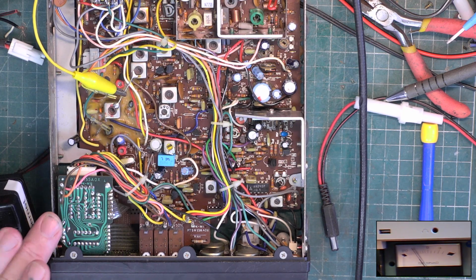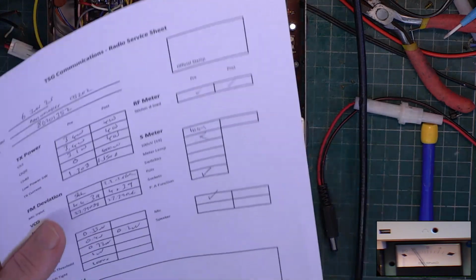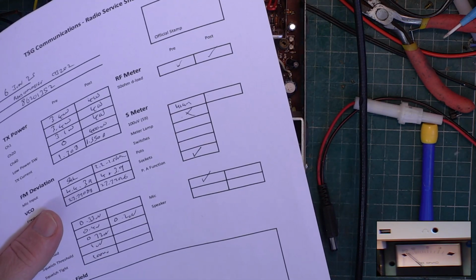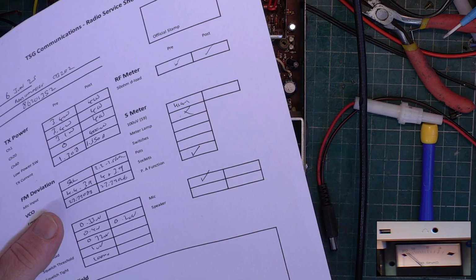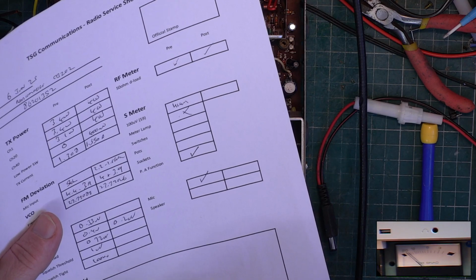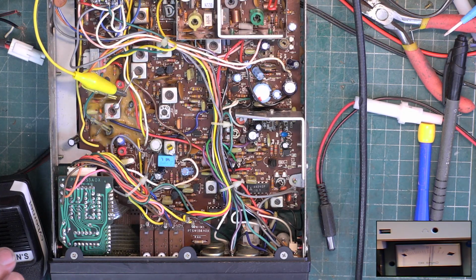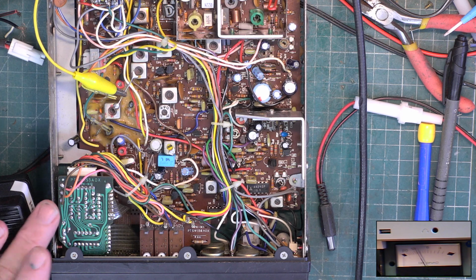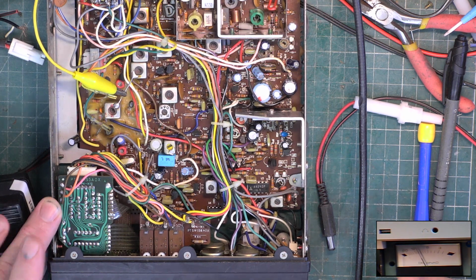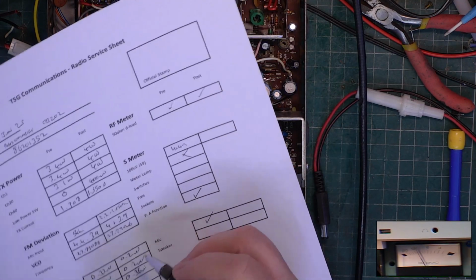Yeah. For 12 dB, we've now got 0.2 microvolts. I'll do 20 next because we're going to be between scales. For 20 dB, we've got 0.36. I'm between scales again for 10. Yeah, it's 0.2 again. Could be like 0.195.